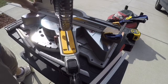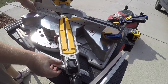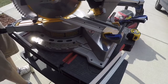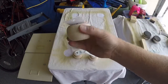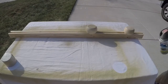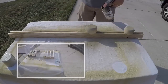We set up a stop block on our miter saw and cut 45-degree angles going from one side to the other to get the same lengths for each piece. Repeat these cuts for however many pieces you need depending on how many filing cabinets you have. While dressing up the front of the cabinets, I also picked up small furniture feet to put on the bottom just to lift them off the ground a little bit. Now let's paint everything — a couple of coats of the same spray paint we used on the cabinets, as well as the pieces of molding we cut.